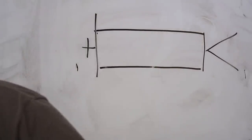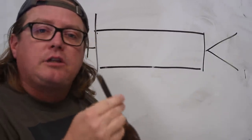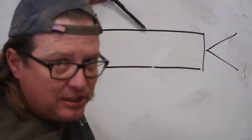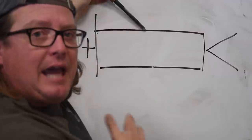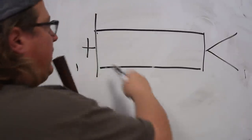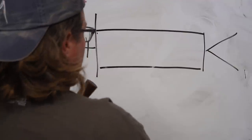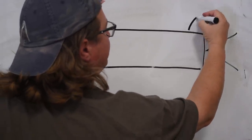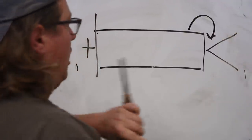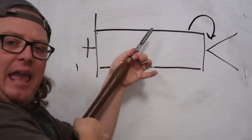So, if you look at our spindle tools, if we grind our spindle gouge at a 40 degree bevel, well, look at that. It's about the same angle as a hand plane as it engages the wood if we were going across it this way. But the thing is, if this is the headstock, and this is the tailstock, this is the blank we have on our board, and it is rotating around this way, when we use something like the spindle gouge, we are constantly changing this back handle angle.